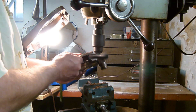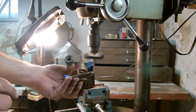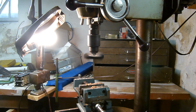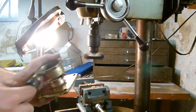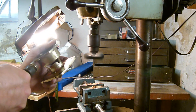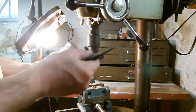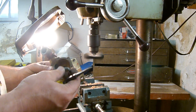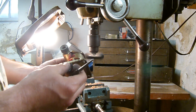There's a chance to look at the housing and make sure there's no cracks. I don't think there are, but at least we can repaint it. One thing you want to look at when you get the pump out is to make sure there's nothing stuck in there. What I found was right up in this hole, there's a piece of an impeller — some sort of rubber. Look at that. It's a piece of an impeller wedged right in there, blocking the flow to the engine. You couldn't find that until we got the whole thing out and started cleaning it up. Good thing we're doing this.